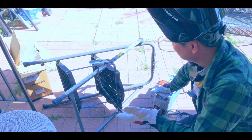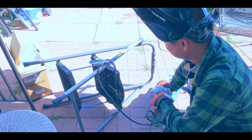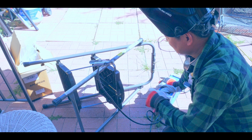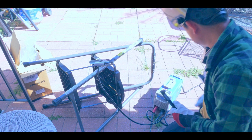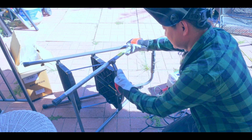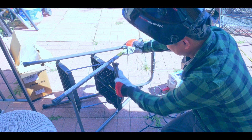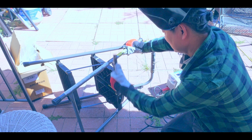Not bad. What I learned is that you need to go above 70 amps — about 80 amps is better. I also think you want to let the machine warm up for about a minute before you start welding. I'm sure I'm not doing the best welding job, but for a small joint it's not that bad. Let me turn off the machine and clean it up. A professional welder would probably laugh at me, but as a hobby to get into, I think it's decent.